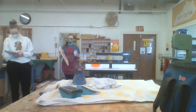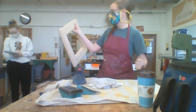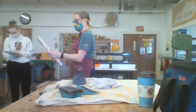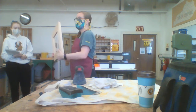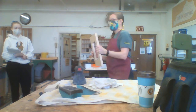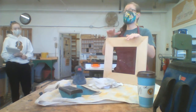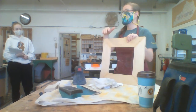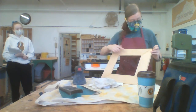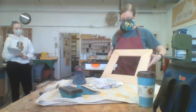This for example is a basswood mitered frame that I made as a demo for your next project. You can see the grain goes in different perpendicular directions. If I tried to hand sand this I would damage the corners. Because this is basswood and it's going to be painted and carved, it doesn't have to look amazing — what it does have to do is have consistent surfaces all the way around.